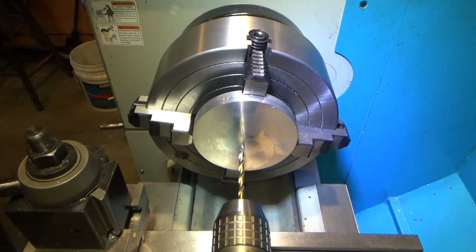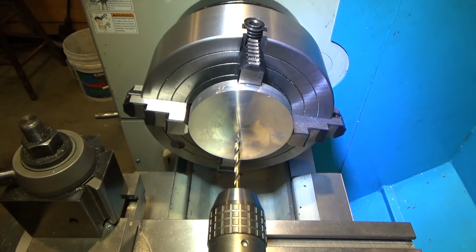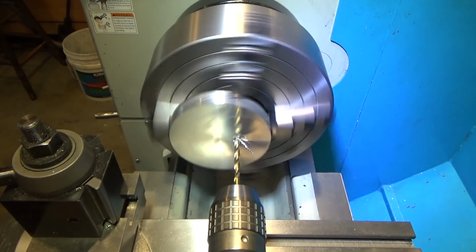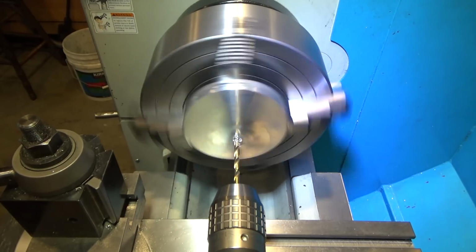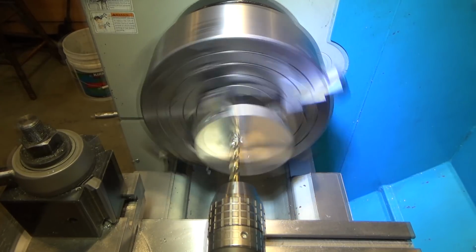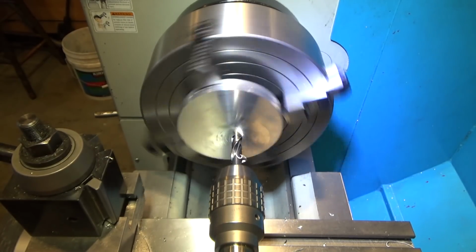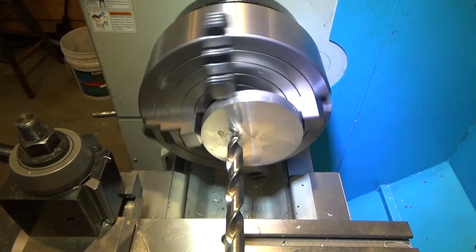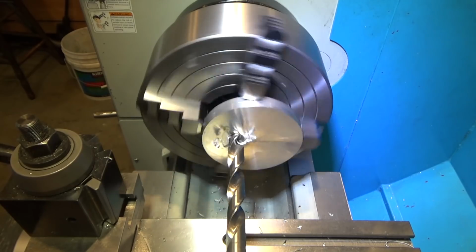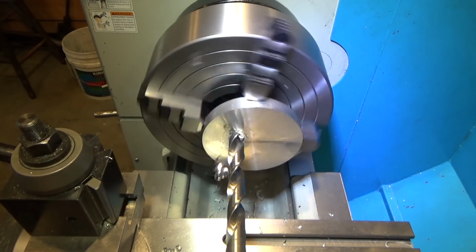So this material is fairly thick, so I will be using lube, mostly to keep the drill bits from sticking, but I am going to go fairly slow here also. I am going to be going right now 300 RPM with a 1/4 inch drill. I can't push too hard because there's nothing back in the part. Just over 3/4. This might be pushing it. We'll see how much force is needed. I can always return to boring. Or go to boring, I should say. Looks like it's cutting well. I just sharpened this guy. And I'm pleased that the chips are about even.